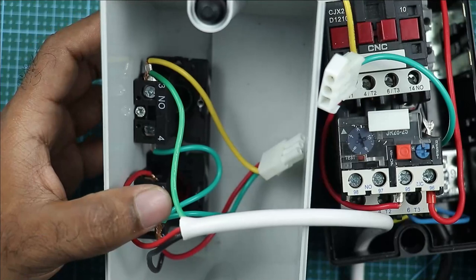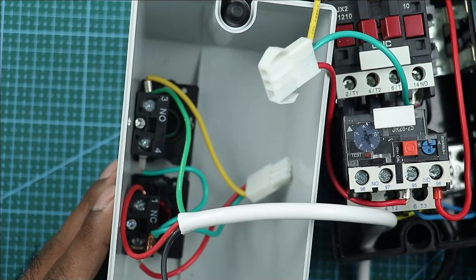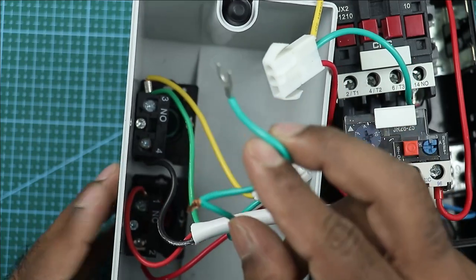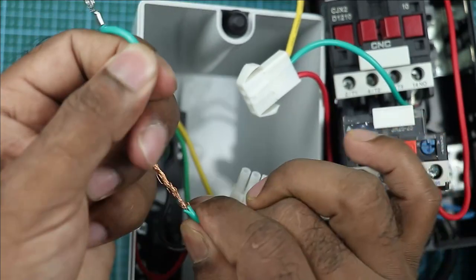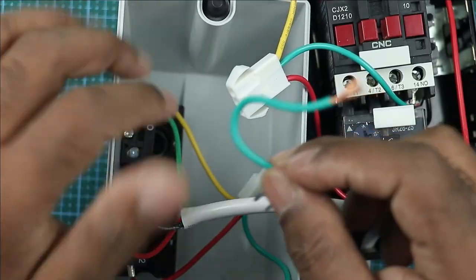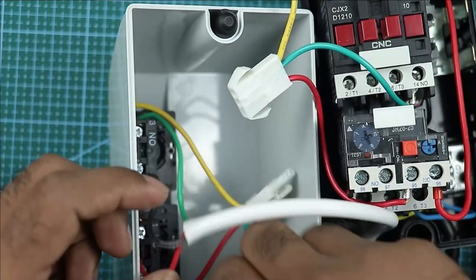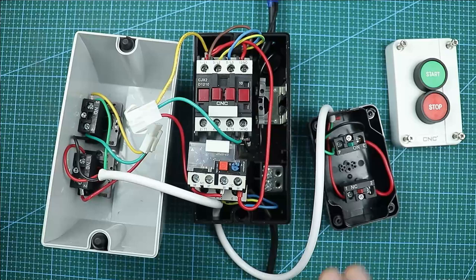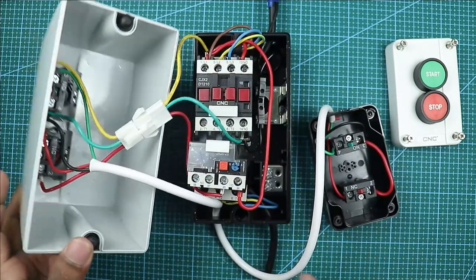I am connecting the wire at this point. Now through this black wire, we have to provide input power supply to the NO contact. First remove the wire which is already connected — this wire will now be connected in its place. The wire connected earlier is for the holding circuit, so it is to be connected at the same point. The wire which was already looped needs to be removed because we are separately using start and stop push buttons. This wire for the holding circuit is to be connected at point 4 also. All the connections to turn on or turn off the starter from a distance are now completed. Let's pack up. After this, we will understand this through a circuit diagram.